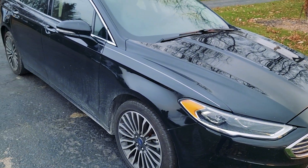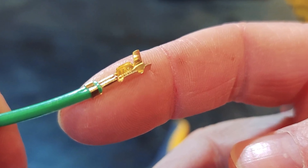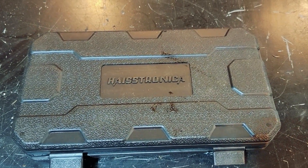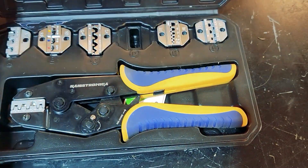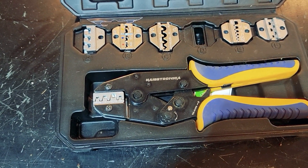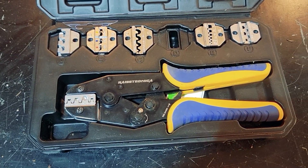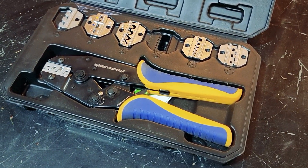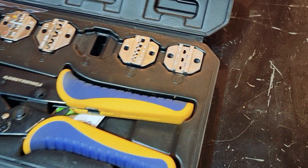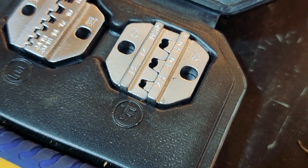Let's take a look at the process of actually doing an open barrel crimp. To do this you'll need a set of crimpers designed for open barrel connections. The crimping pliers need to be ratcheting, as this will help during the assembly process, and will of course allow for various sizes of open barrel connection. I went with Hastronica brand pliers — they've worked fine, though I'm sure professionals are using a step up with a machine die surface as opposed to the cast on the Hastronica.